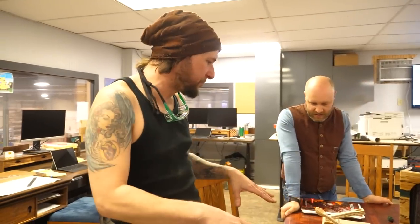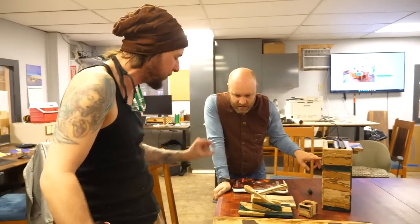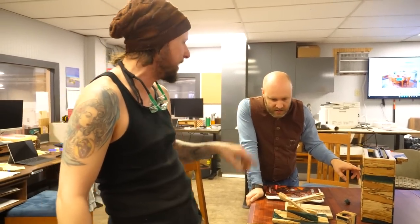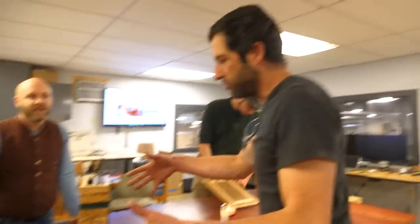I made two resin pours to achieve this. I did a nice thick one, and then I made another large one, but it was only about 3/8 of an inch thick, and I just milled everything out of that. So you took some big, janky spalted boards, glued them up with resin to fill it all, and then just treated that as lumber. Right. Yep, that's much smarter than what I would have done.